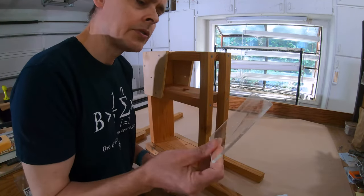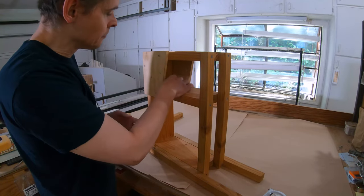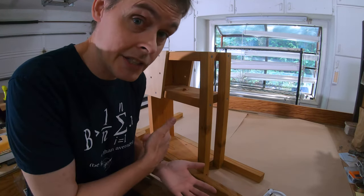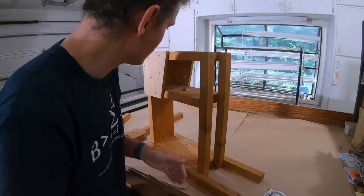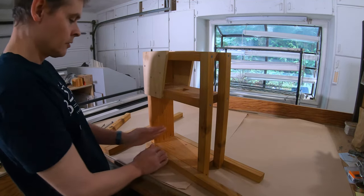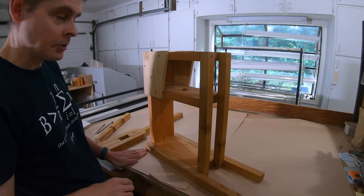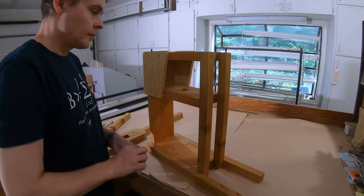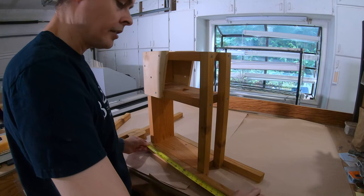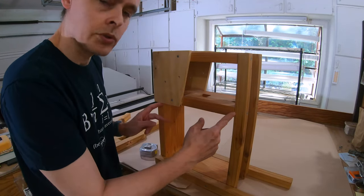The directions called for a piece of plexiglass, 4 by 5 inches, to slip back here. Honestly, I'm not sure that it makes a big difference — maybe it keeps it from denting a little bit back there, but I don't think it really matters to the cheese press. The 2x6s are 12 inches from here to here, and 20 inches from the tabletop to the very top, which means these 2x2s are also going to be 20 inches tall. And these support base 2x2s are 22 inches long.